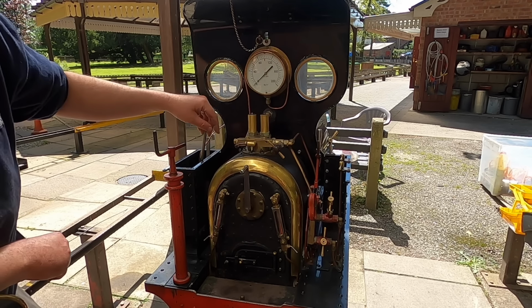We have the locomotive handbrake, and the tender has air brakes, which can also be connected to the train and be controlled via valve here. So this is the control valve for the air brakes. It's a simple brakes on, brakes off. Two injectors are here, just below the controls for them.